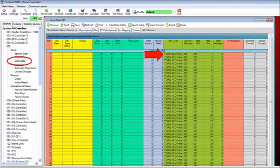So I can reorder my map stations to correspond to the stations over here on the left in the red column in zone data. That's your actual station numbers as it's going to operate from the software or from the faceplate. The map station just allows me to reorganize my decoder numbers to correspond to whatever station I want. So it does give you a lot of flexibility. It's not so important that you have all of these decoders numbered and programmed, either from the handheld programmer or from the controller programmer, into a particular sequence. You can do these however you want and reorder them in either the faceplate or from zone data right there.